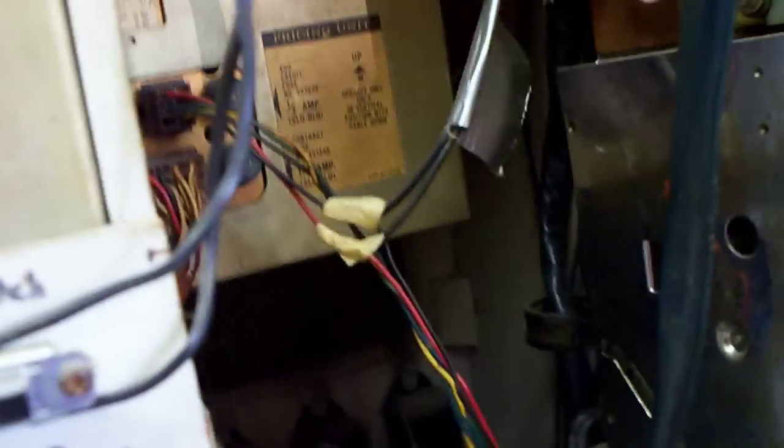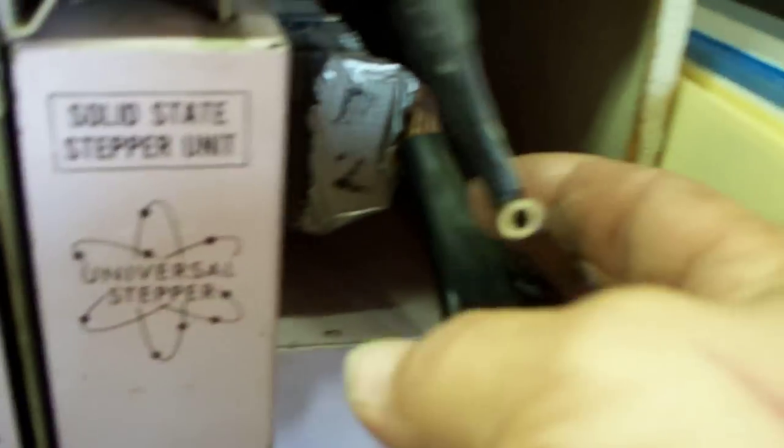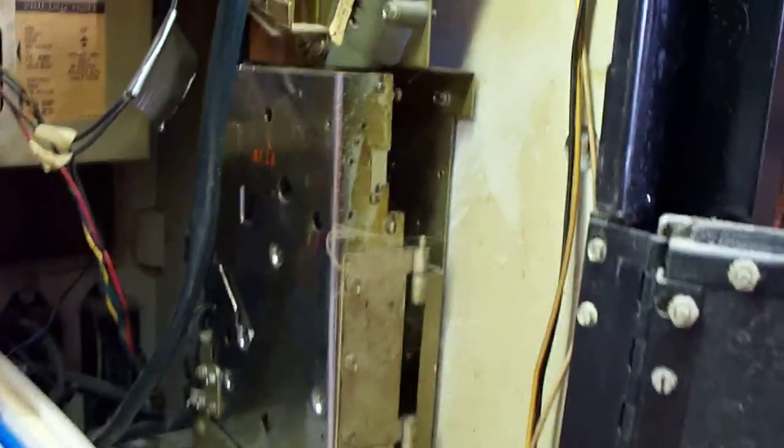I relocated the service switch down here because this is where I service it. There's the opening sealed off from the income totalizer. Now 90% of the time those are in there, but they're bypassed because they burned out. And I don't remember, but somewhere in here where the wires are, there's a diode or resistor which takes up the income totalizers. Yeah, it's right there. And I think these are for the coins. There's 25, 50, and 10 cents coming in, and then they're all joined together on one wire, because the wall boxes don't need to count how much money they're bringing in anymore. All the coin gear is functional, although I also have a cheater switch connected to the scavenger cable.